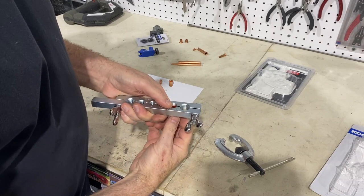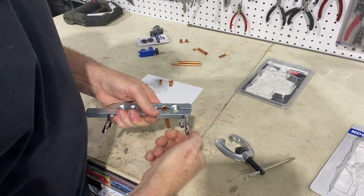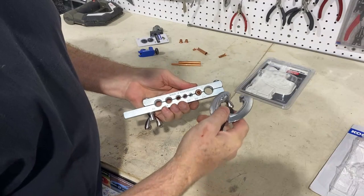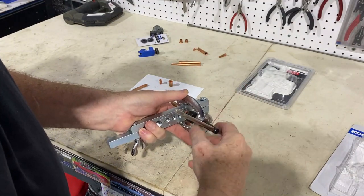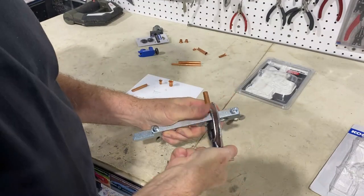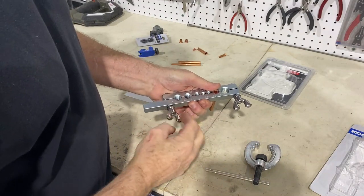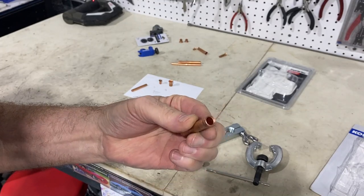This is a problem I was having before. Quite often it just pushes the tube down within the clamp — it did not flare it, it simply shoved it through. So loosen it a little bit, put it a little further through, and try it again. Depending on your wrists or your hands, especially if it's cold, it's kind of hard to do, but it's clamped in there as tight as it will go. So we're going to put this back on and try to run this down on top of it to see if we can now get a flare. I'm having trouble getting it to do this — it doesn't even want to hardly flare it. That's certainly not going to work.